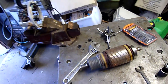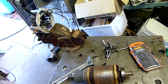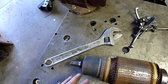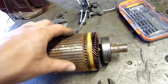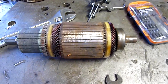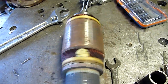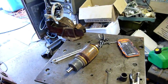The field housing is sitting in a bucket of water at the moment. I've given the poles a bit of a scrub with some emery cloth and scotch bright and they've come up alright. I'll just sand that rotor off and turn it down. That bearing is still nice and smooth and clean, so I'm not going to contaminate it by washing it. It really is just a glorified starter motor — a big one, very big.